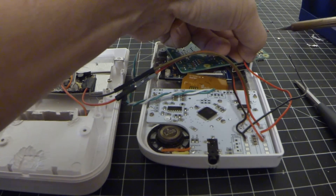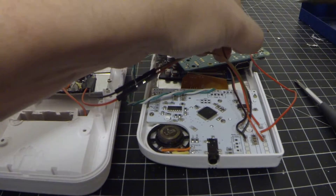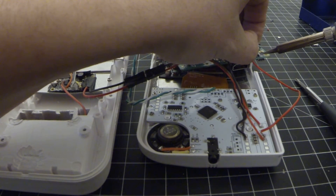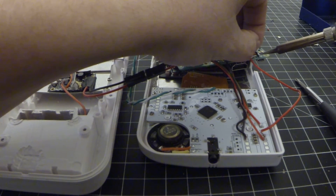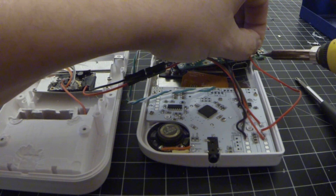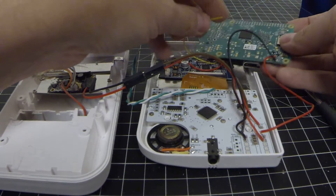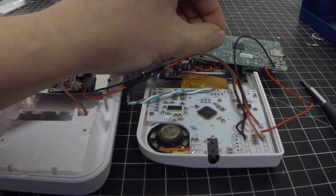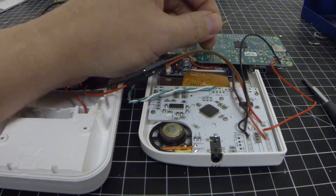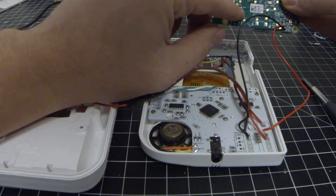Make sure you don't hit any of the ground spots, because if you hit a ground spot — at least for the 5V power — you're going to have a bad time. It's basically not going to power on. You may get a spark, you might not, but it's not going to power on. So the video is going to be test point 24, PP24.